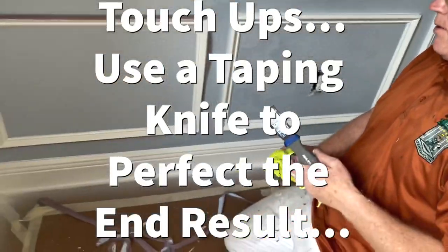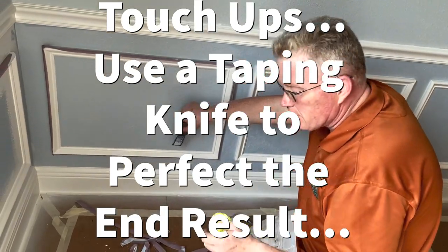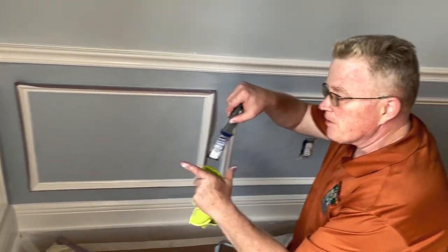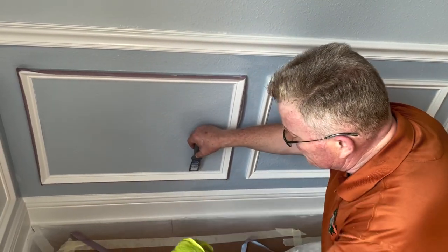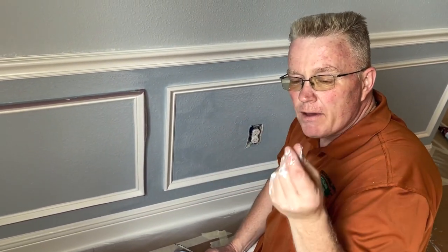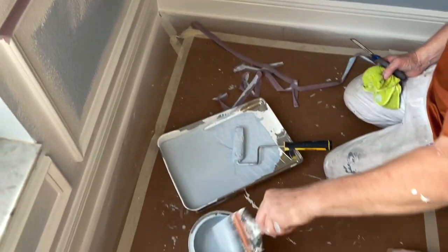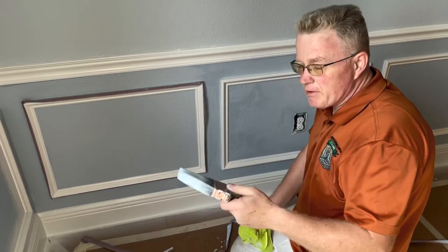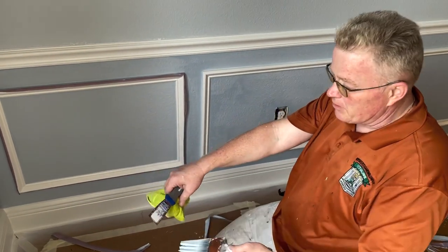Okay, so you take, make believe this is 10 inches wide. Put it right in here. You dip your brush. You knock all of the paint off that you can. Make believe this is 10 inches. Let's say you got the blue on the white. You put it right up against there. Perfection. But you have to make sure that the paint is barely there on the brush. So you dip it, and you're coming up with a brush that barely has paint on it. And you're just doing one of these lightly. You make the straight line just by the speed of the brush.